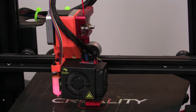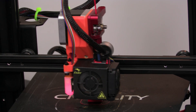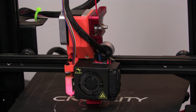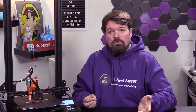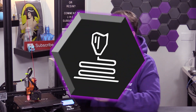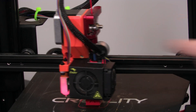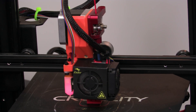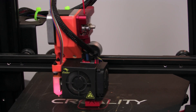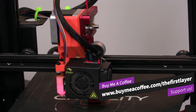So after doing some digging, I found a model file on Thingiverse as a drop-in replacement to make your Ender 3, or in some cases CR10s as well, Direct Drive with only a single 3D printed part, which you'll see here. This part on my Ender 3 right up front was available on Thingiverse — I'll post a link in the description below. It was printed on this Ender 3 before I converted it from a Bowden to a Direct Drive.